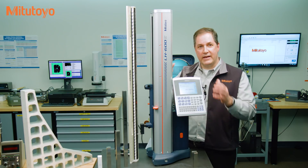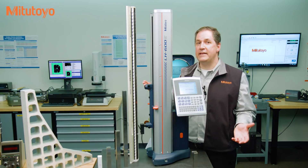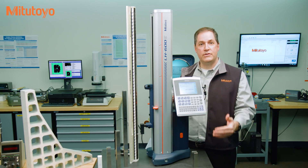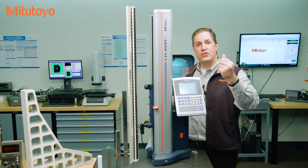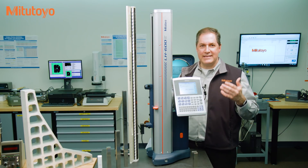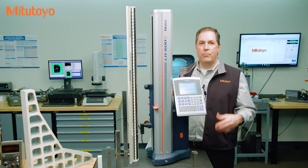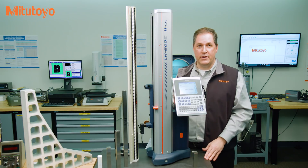You could hire somebody to calibrate this linear height gauge — they could do some tests, find the height to be significantly out of tolerance, and still issue you an accredited calibration certificate with those results, stick a new calibration label on the instrument, hand you an invoice, and say 'all done' — possibly without ever discussing the out-of-tolerance condition with you. This is a problem born from different historical usages of the term calibration and also from price pressure.